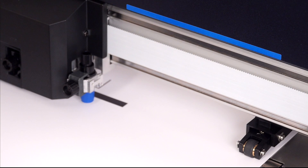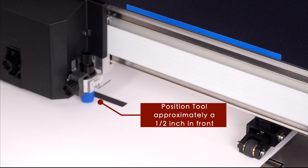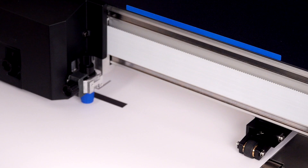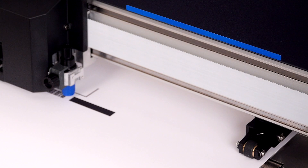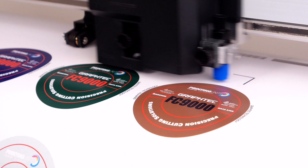Therefore, when positioning the tool head, position it approximately half an inch in front of the black start bar. Once the tool head has been positioned, press enter on the control panel. The cutter will scan for the black start bar and will immediately scan the barcode. The barcode provides the file name containing the cut data. Once it finds the file in the Cutting Master 4 job queue, it starts to process the job by first finding the registration marks and then cutting the contour.